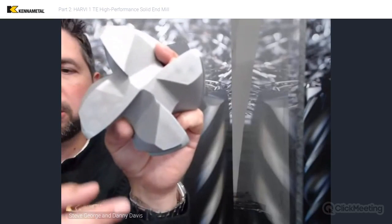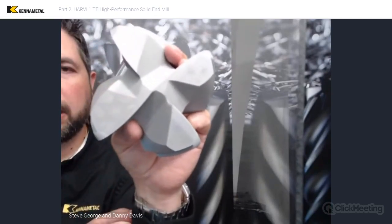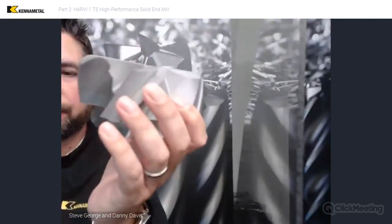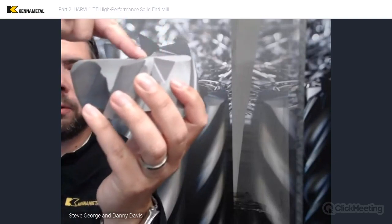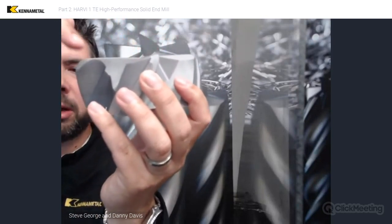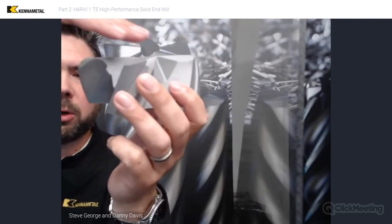It's a really neat design. Not only do we have the twist that you see on the end when you look that way, but one of the other interesting things is that we actually have a curve across these edges as well. Normally on an end mill you have a dish angle, and that dish angle is normally the limiting factor for ramp. But in this case we actually have a variable dish, so we have a curve going across this way.